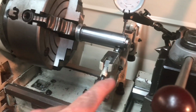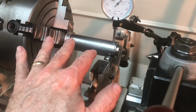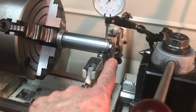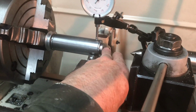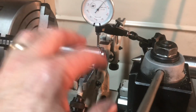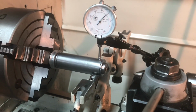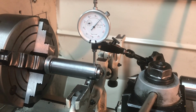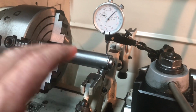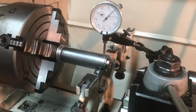So I'll just tighten stuff up, put the top on, and the next step, what I'm thinking is, now that I'm really certain the tube is straight, I'll use a different indicator, the little Interapid half thou indicator, I can put inside the snout there, and make sure that the spindle is perfectly indicated, straight and level before I start machining the 40-degree taper. But having it to this point, I'm quite confident that everything's extremely close. I mean, within a thou or so on the outside, so it should be very close on the inside. We'll find out in a minute.